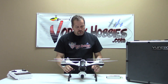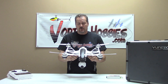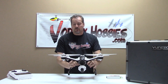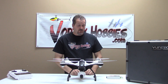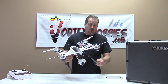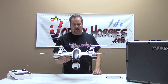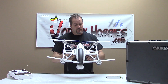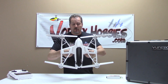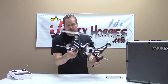This quad has a standard GPS, altimeter, and compass — all of which, the compass anyway, requires calibration before you fly it. You should probably calibrate it every other flight, or if it has a hard landing, but that's a simple process. This is probably one of the most stable platforms I've ever flown, and certainly the quietest because of the low KV and the larger diameter prop. Very robust, built very well — lots of bracing, so it's a real rigid airframe. Landing gear is wide and very stable, with little cushions on the bottom.